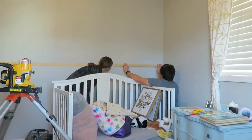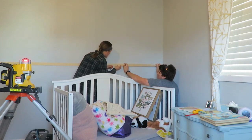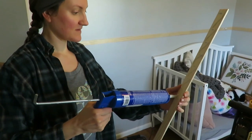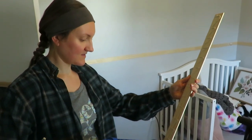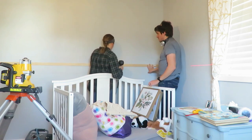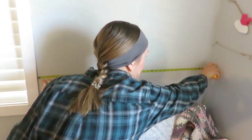We put up our horizontal pine board and nail-gunned it in. First you need to apply liquid nails — just a slight bead in a wave pattern. Not too much that it oozes out, but not too little that it won't hold. We had to cut a few boards; my husband did most of the cutting, measuring everything and using a miter saw at a 90-degree angle.